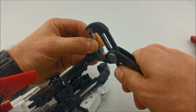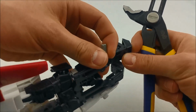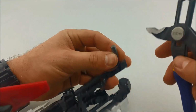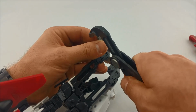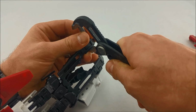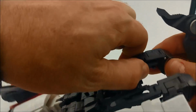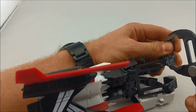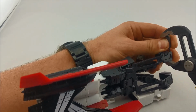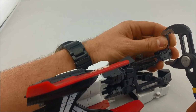And then just going to gently squeeze until it starts to move. Now that we've got some movement out of it, and you can see the flashings cleared out of the way, we're going to get our grip out of the way completely. Make sure you're going straight up and down here. That's what allows you to get the pressure without doing any damage. See, the pin has now started to come out. So you want to get it just off to the side. Adjust these down now. And out comes the pin.